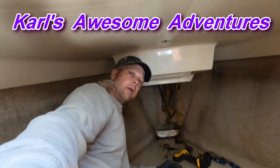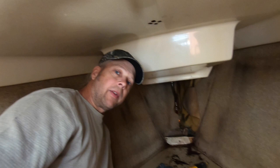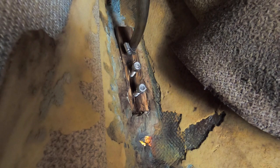Okay, I'm working on the front pad eye, which came loose when I hauled it out the first time. I thought it was going to pull out of the hull. So here's what it looks like. The wood is all rotten here, and there were washers on here and they were starting to just pull through that rotten wood. So I'm going to take this off,